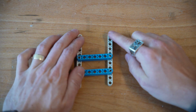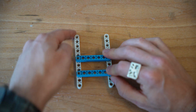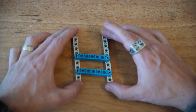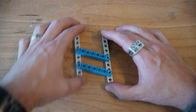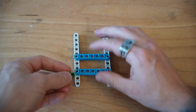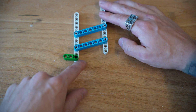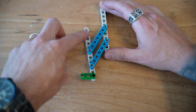So you've got your base, you have your 2 arms that pivot from that base, and then that 4th link is the coupler, and that connects the ends of these 2 arms together. And because it is a parallelogram, as that lift moves with that coupler link, where that gripper would be attached, it stays parallel to the base. So let's go ahead and add our simple claw arm here to that coupler, and you'll notice that as we lift ourselves up, that gripper stays parallel to the ground the whole time.